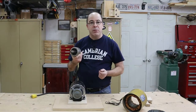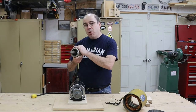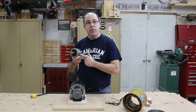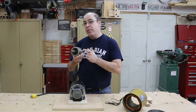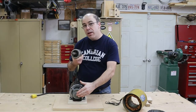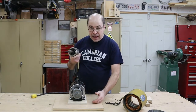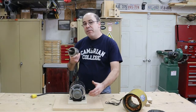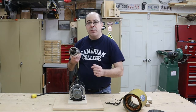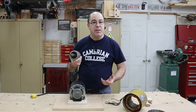According to popular electrical textbooks, this is bad. What happens is the motors depend on counter-EMF to help regulate current flow. If I stop the rotor from turning — whether by putting too much load on the motor, or in the case of today's demonstration, physically stopping the rotor — we're going to observe what the result will be.